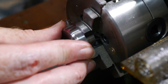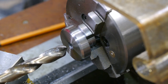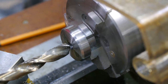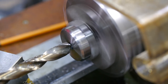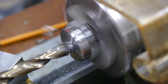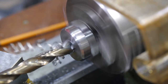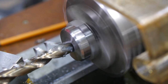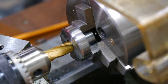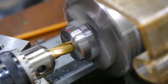It was easy enough to set up the part to drill the counterbore, as the exact diameter and concentricity aren't critical. The 10mm drill leaves half a millimeter of clearance for the screw cap. I used this counterbore cutter to ensure the shoulder at the bottom of the counterbore was level. This helps prevent the screw from exerting any side force as it's tightened.